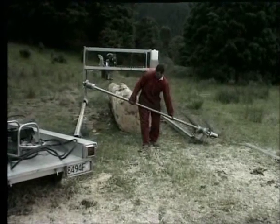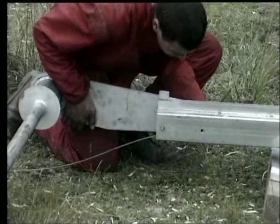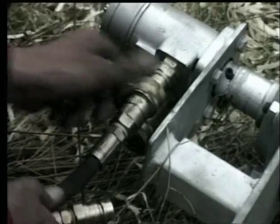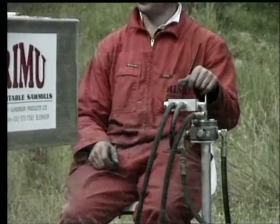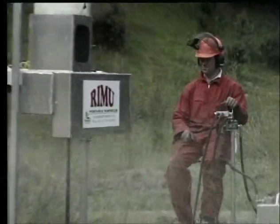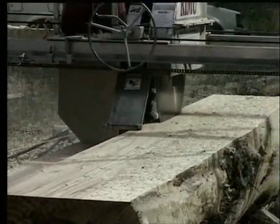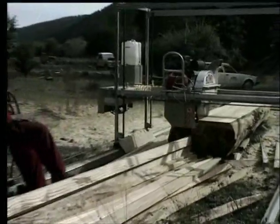Here we see the automatic hydraulic attachment which can be bolted onto the standard Rimu mill in a few minutes. It has a separate power source so that it doesn't steal power from the main sawmill. It has a variable speed control which can be set by hand while you're cutting. It propels the mill through the log and returns the cut timber, allowing the operator to stack timber while the mill is still cutting. It's set to return the timber as fast as possible.